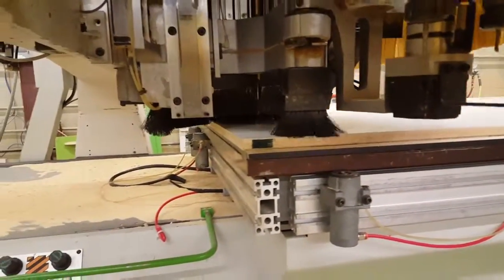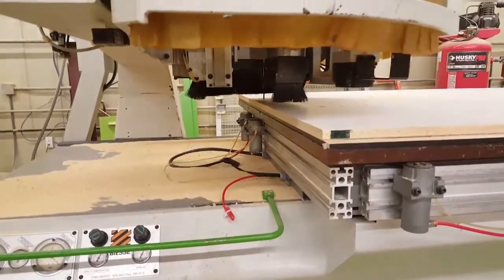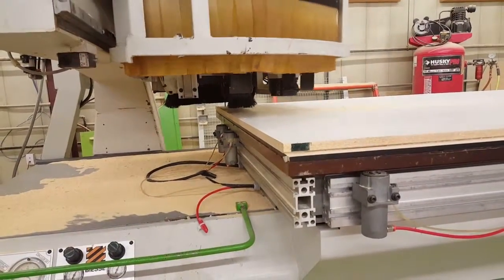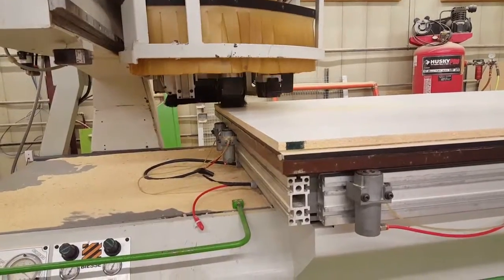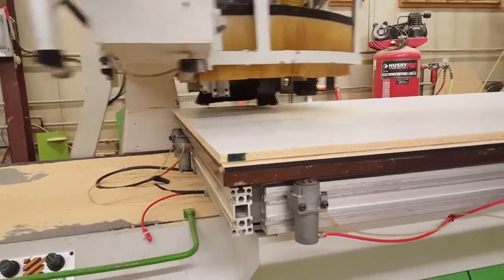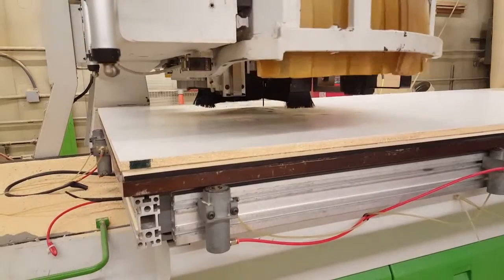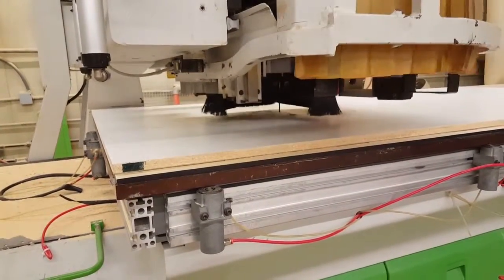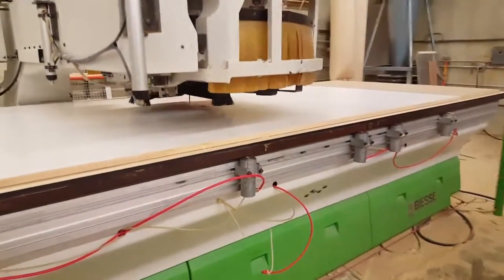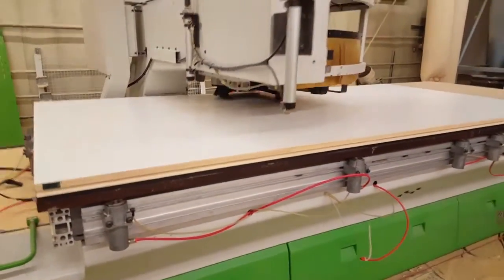You can have a brad, which is a flat end bit. That's good for doing dowel rod holes or insert holes for inserts. I'm running a program right here for doing a ton of holes for how we build cabinetry here at Axis Designs — that's one of the ways. Just thought I'd share it with you.